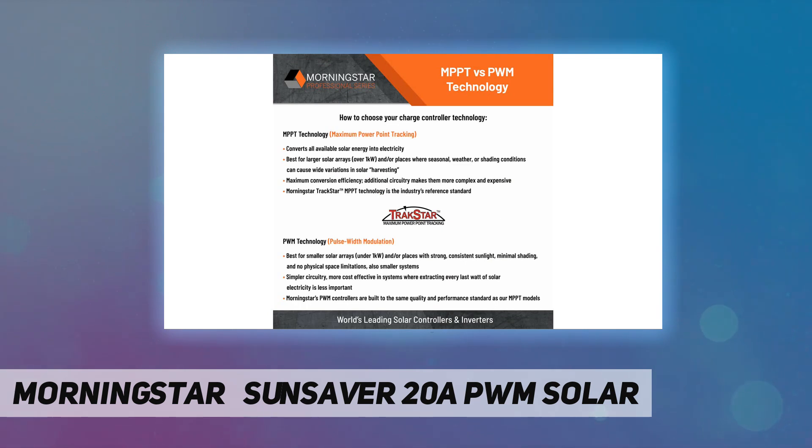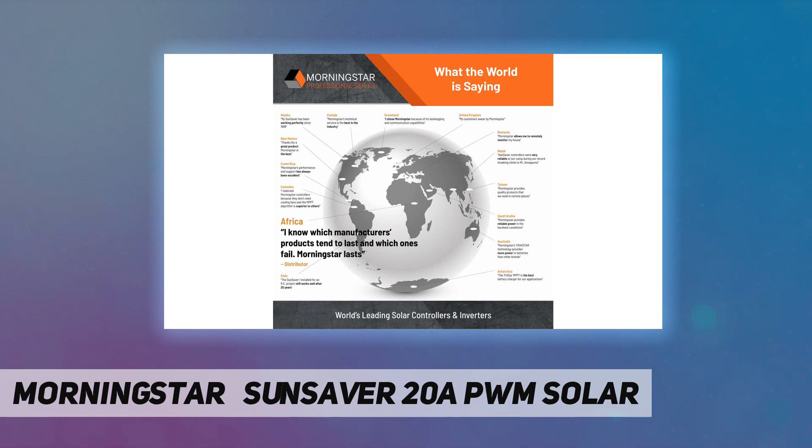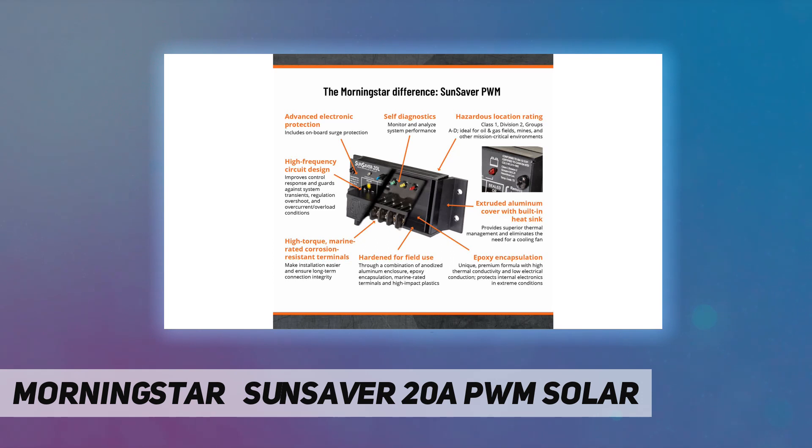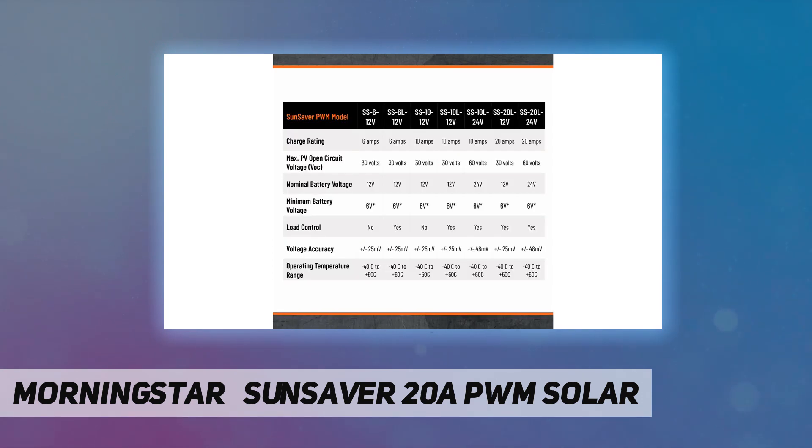System compatibility: designed for use in smaller systems with max solar load current up to 20A, low voltage disconnect included, and constant voltage PWM regulation for multi-stage charging. Ideal for use in cloud-connected network systems through communications protocols.